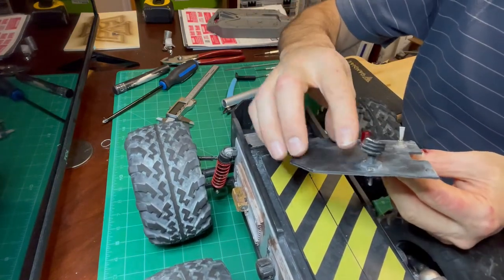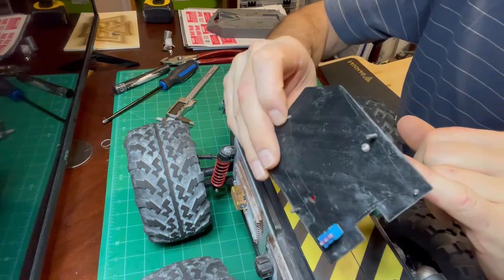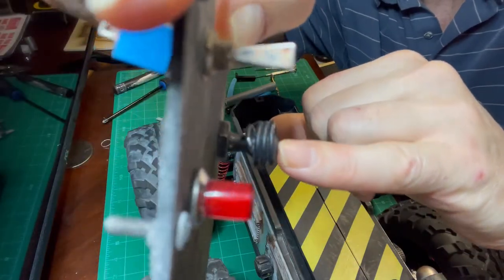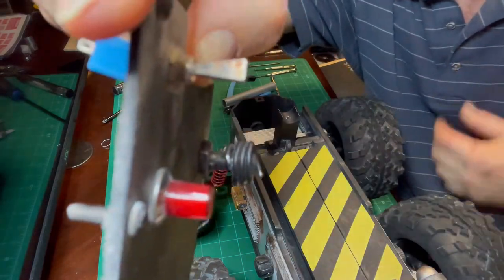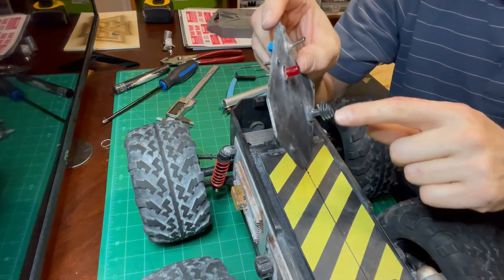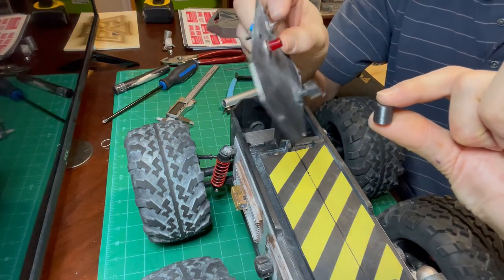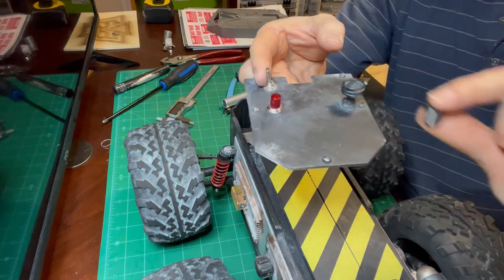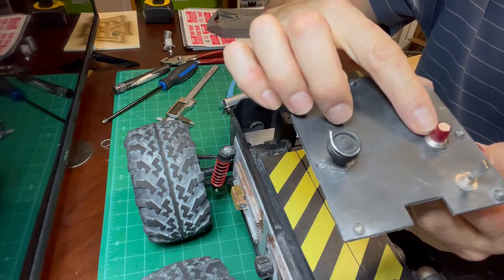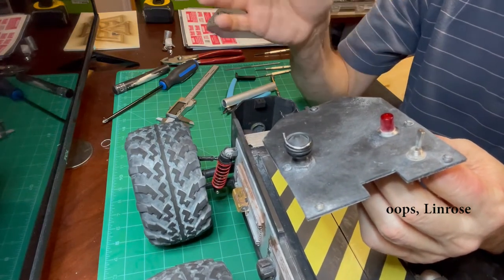The back plate has got the antenna. There are a couple versions of the antenna — one version's got the wire wound on it and there's a spot where the wire goes right into the plastic. It's a bit tough to jam it in there — this is 2 millimeter wire. You may have to drill it out or sharpen your wire on the other end. This other piece is what you wrap your wire around for the antenna to get the right width. It's held in with an M3 screw, and then we've got the high-rise top hat here.